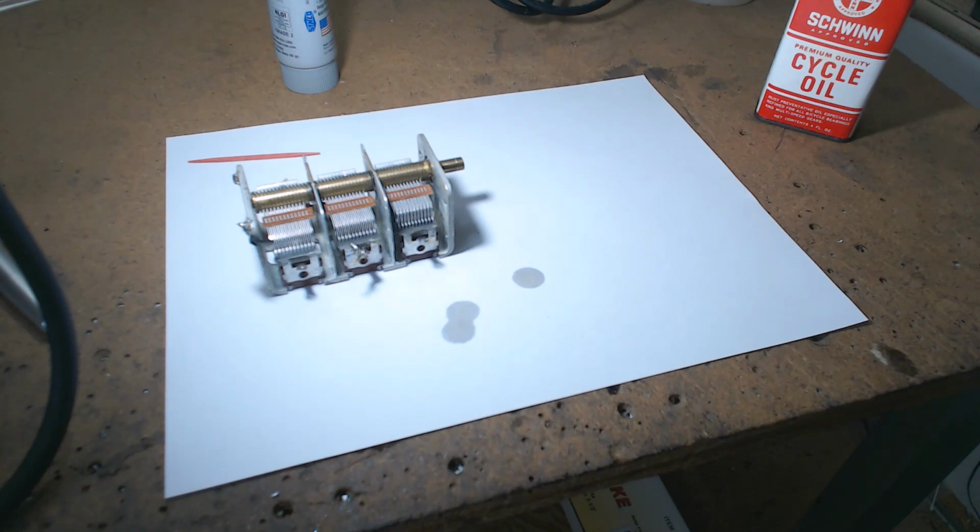Okay? Now, if you get, when you're cranking the dial tuning, or you're turning it, and every revolution there's like a clunk in it. All right, that clunk is caused by the radio was dropped and the shaft is bent, or you got some sawdust sitting in the grease, a piece of solder, a piece of stripped wire. Over the years, I found all kinds of things, even a staple one time.